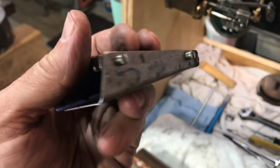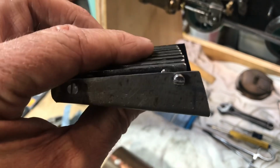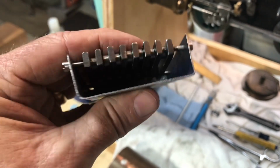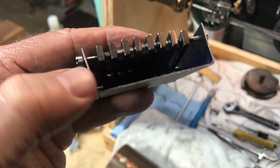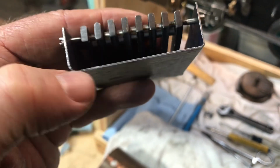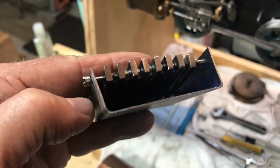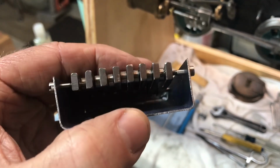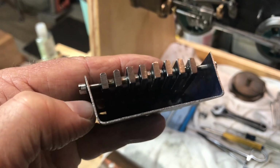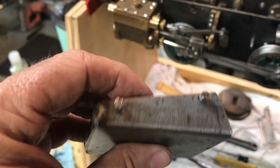Having never run coal before, I'll have to defer to the advice of those that have, and I see the valid point. I'm thinking maybe let's test fit it and see what it looks like in place. One option would be to drill the holes like LBSC calls for, and instead of having a bar that goes all the way across, have a couple of bolts that come in from the side. And in that case, having the front support would be even handier.